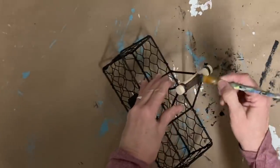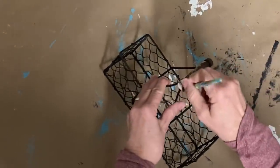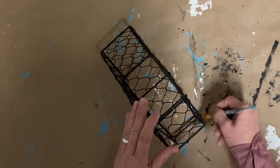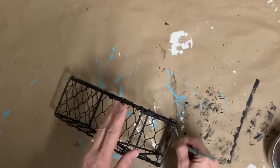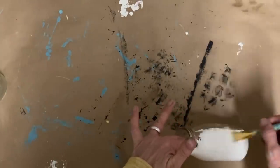Here is the finished product. I had thrifted this little caddy and I've taken it out and spray painted it with a matte black finish. I covered the little wooden handle with masking tape because I wanted to go back and put some antiquing wax on it, which is what I'm doing here. This little caddy was kind of a brownish color and I felt a flat black would look a lot better. I'm just using the Dixie Belle wax in the brown, putting a good coat with a brush and then wiping it off. I very rarely use an oil stain anymore — I like the waxes because there's no odor and they're water soluble.